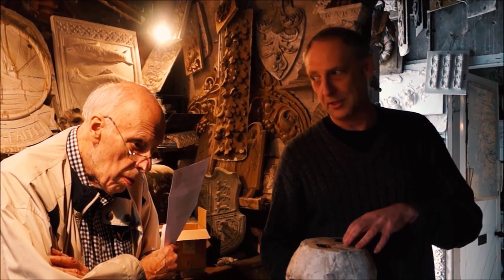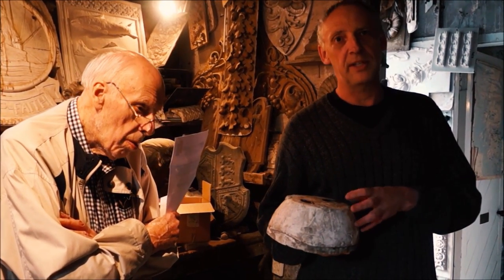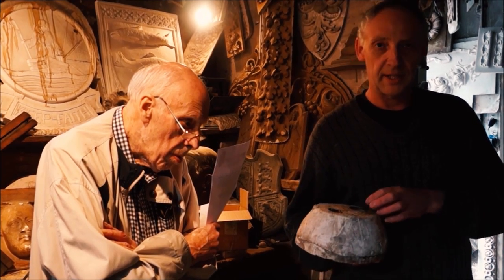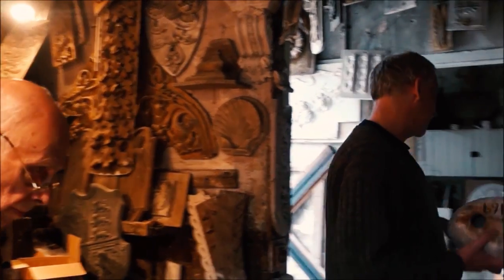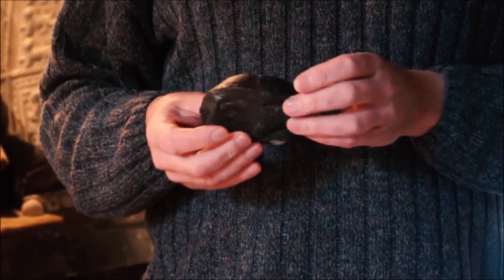The obvious disadvantage is that once the wax goes cold, it goes solid, so you could only make something that would pull out of a mould. If you've got something that's relatively three-dimensional, or with what we call an undercut, then you couldn't get it out. So early plasterwork either tended to be relatively two-dimensional, or made of such a shape that it would pull out of a mould. The breakthrough came with the introduction of gelatin. That's a bit of gelatin there — it's about 100 years old so it's brick hard, but in its time it was relatively rubbery.